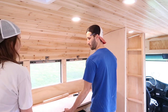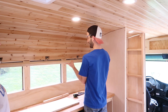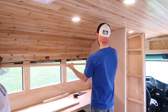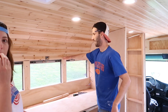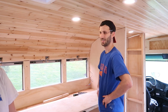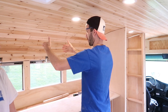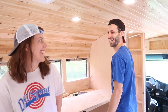Our plan is to just take one big piece along the bottom that will serve as our base. That'll run basically to where our ceiling comes down, and then we'll have some supports coming down from the ceiling. We'll pocket hole this into each side, and in the back we'll have supports coming down. Then we'll just need to put a face plate on it, and we'll have one big box with two supports — so three chambers — and then we'll put stuff in it, like cereal. And a tape measure, to square.